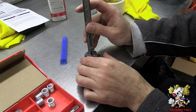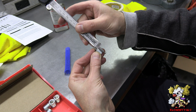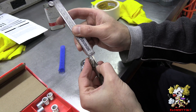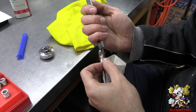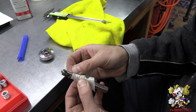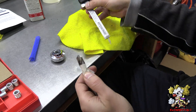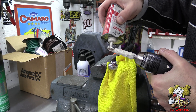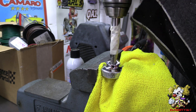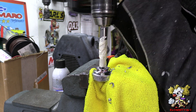Let's begin drilling. First I want to check the depth — there's a lot of area underneath where the bushing will go in. To drill past this depth correctly, I'm going to put a piece of tape right here so I know where to stop. Put some Tap Magic — aka Butter Sauce, Clown Juice — right here, and drill her all the way in. And I think we're there. Yep, we're good.